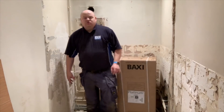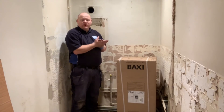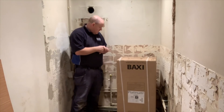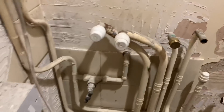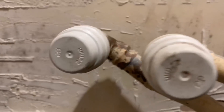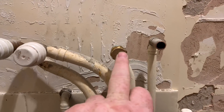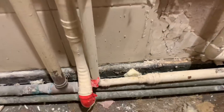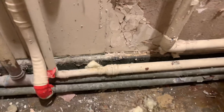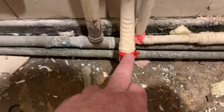The gas also needs updating on this — the gas meter is miles away, so I'm going to update that into 28mm pipe. I'll zoom in and show you what we've got at the moment. I've marked all these pipes and put stop ends on so there's no gurgling or water coming out. The gas is turned off at the meter — it's 15mm down there and 22mm there, but that's not big enough for this job. I've marked the pipe so I know that's the floor level.